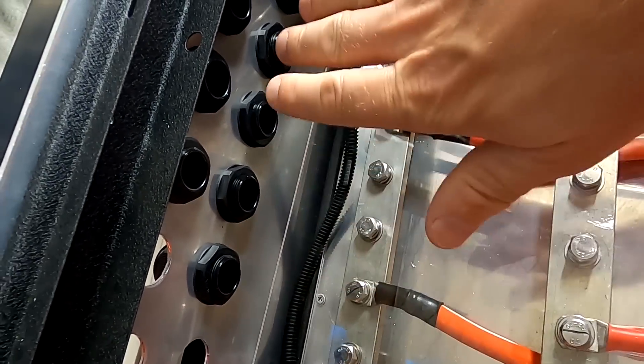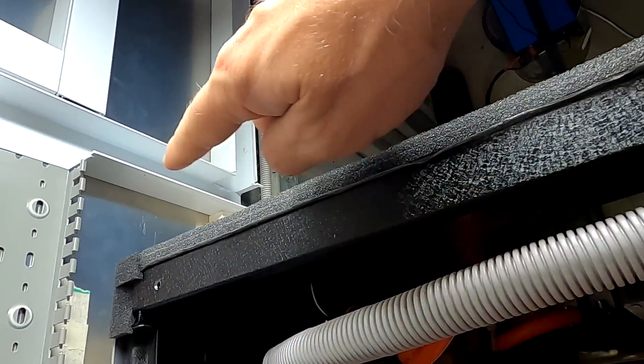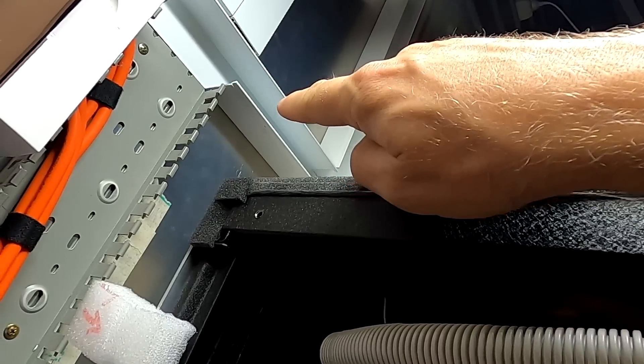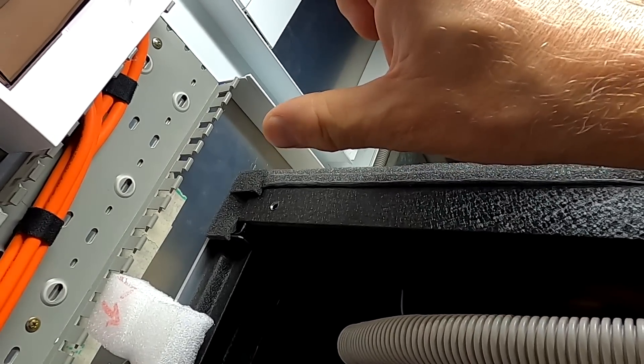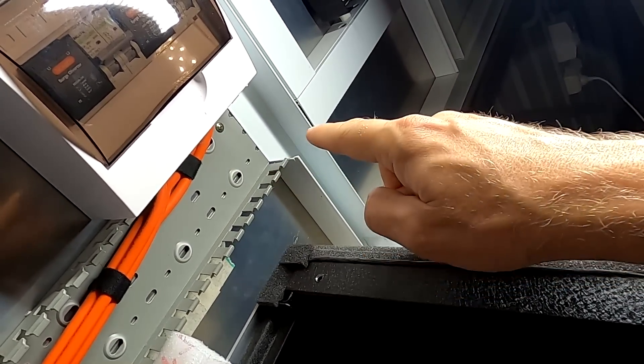The reason I didn't go with that very popular Solution C is because there's actually no slack in the cable — it's really tight from the gland to the bus bar, with no movement possible at all. I will need some slack. I don't know how bending through two 90-degree bends will work with 70mm cables. I was already a bit angry with myself for buying only the 50×50 duct for these DC cables — I should have gone 75×50 or even 100×50.